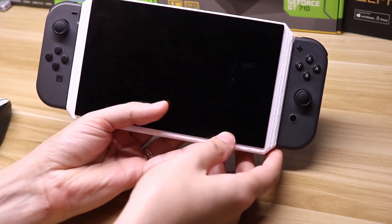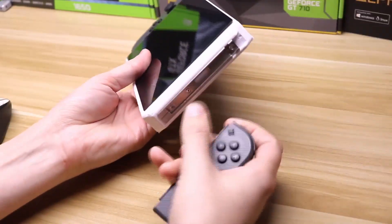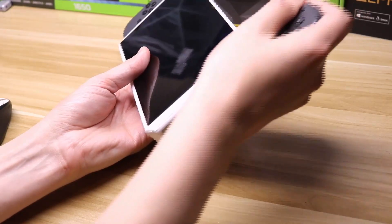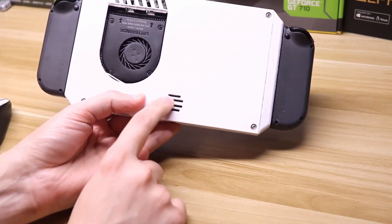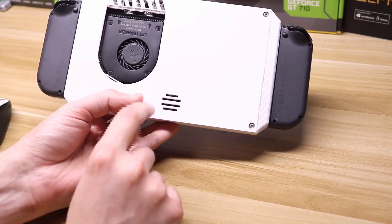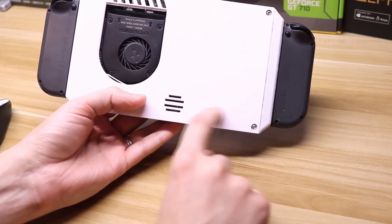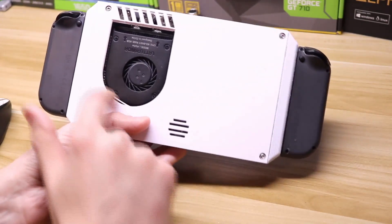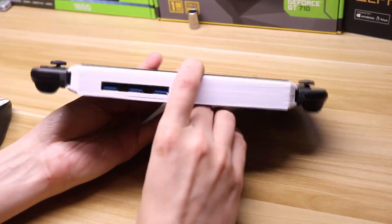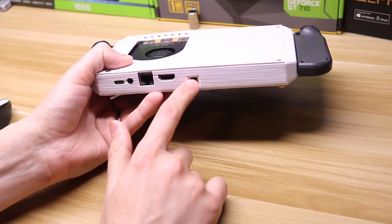Let's go over the features of this build. We have the 7-inch EDP touchscreen for the Latte Panda Alpha on the front. Joy-Con mounts on the side taken from a Nintendo Switch accessory. We have a sound card on the underside of this lid right here and a speaker right here. In a future build I will add a second speaker and a second set of mounting holes right here for stability. There's room over here for a 5,000 milliamp lipo battery pack, which I'll leave a link to my tutorial in the description below. Large ventilation area right here, access to USB ports on the top with additional ventilation, access to the bottom ports here, and there is a built-in power button right here recessed into the case so you don't accidentally hit it.